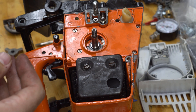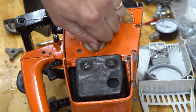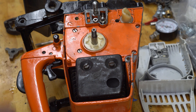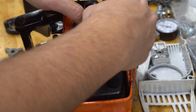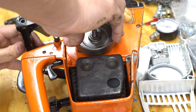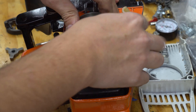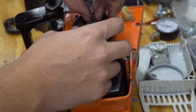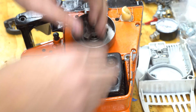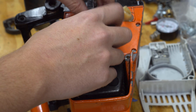Now you have the cover back on. Take your new 3D printed part and put that in place — it should be flush with the lip, which means it's engaged on the oiler gear. Take your sprocket and make sure you're using the new one and not the old one. Put those in and set it down inside of the printed part, making sure it's sitting flush. After you've got that in place, throw the little clutch shoe holder on. You'll need this washer first — it keeps the clutch shoe from touching the bottom, because it's only supposed to engage on the sides.